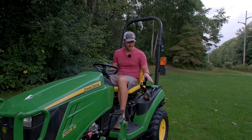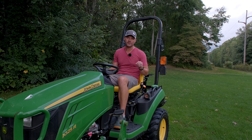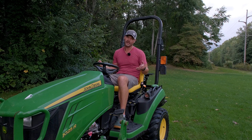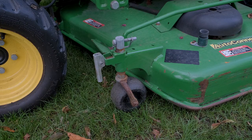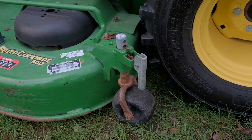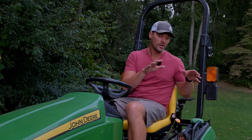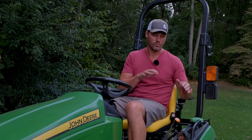I'm then gonna take a look at the gauge wheels, all 4 of them on each corner there. They are not designed to ride on the ground. So if you're wearing out your gauge wheels very quickly, well, they're making contact with the ground and they're not supposed to. The intent for the gauge wheels is to hit the ground before your mower deck does. So if you have an uneven, bumpy ground, and there's gonna be some spots out there, you're gonna see how those gauge wheels make contact and prevent a complete scalp right down to the dirt with the mower blades.